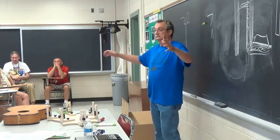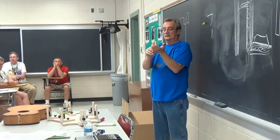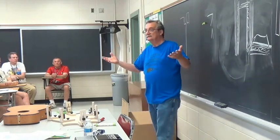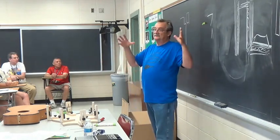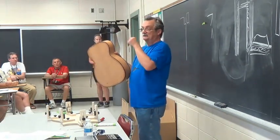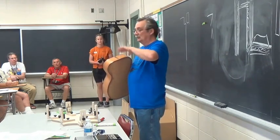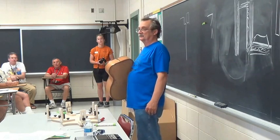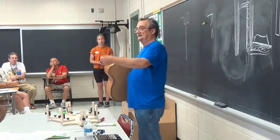Sorry, what was that technique you just described, using lacquer thinner to release the binding? On an old guitar, if you're doing a repair on a five-year-old guitar, or you're doing a repair on a '39 Martin, I mean, they're two different animals. The old celluloid plastic would shrink, and it would usually come off at the waist. And when you're dealing with old guitars, old lacquer, the more you can protect the old finish, in the long run, the better off you are. I mean, Pat's done more of them than I have, but we all learned our little tricks from talking to people. You don't want to create a bigger problem than you're trying to repair.